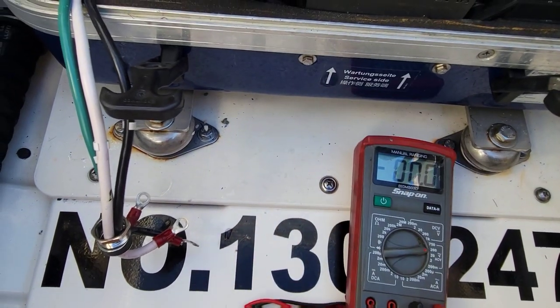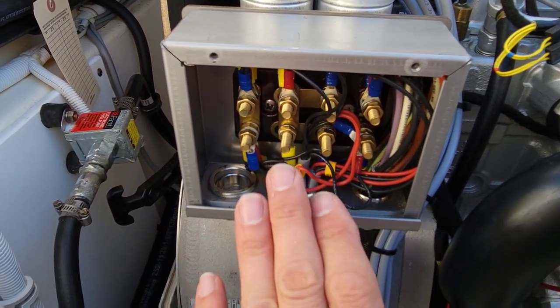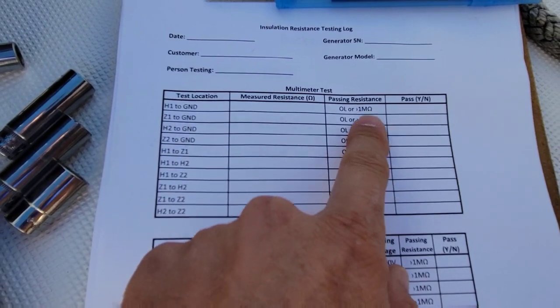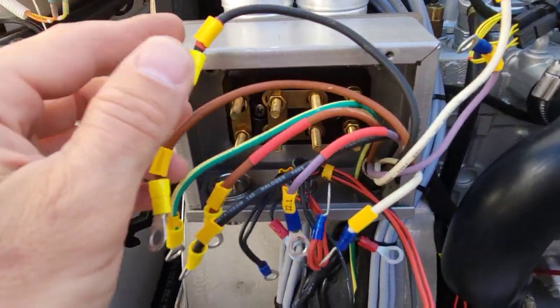As you can see, 0.8 volts is not enough to do anything. So let's pull this stuff apart. I have this paper right here - we can measure our resistance and everything and see if we've shorted to ground somewhere, which is what it seems like to me.